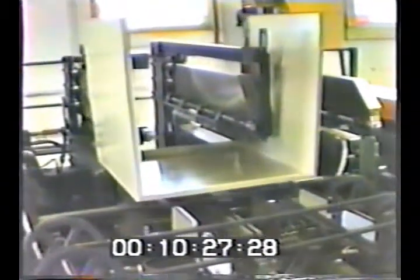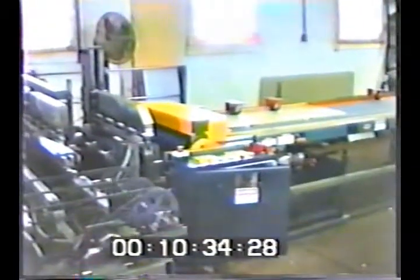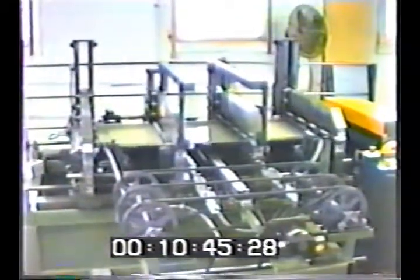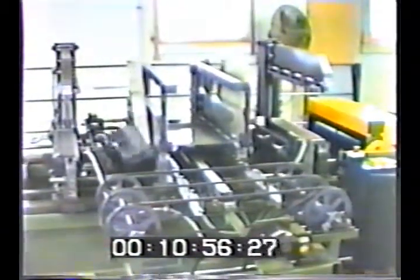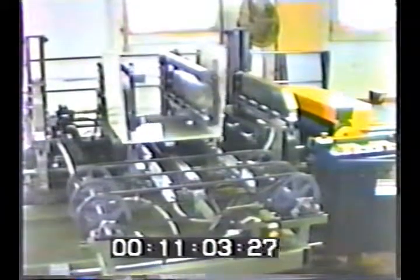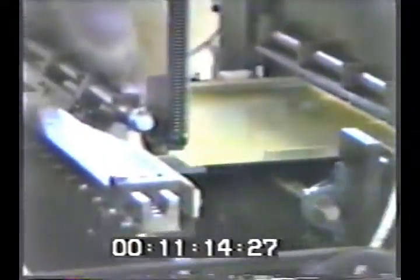The rams are set up on slide beds and pinned in location for the variety of wrapper sizes required. The entire system is designed to protect the pre-painted panels from marking or scratching the painted surface. You'll notice the open-throat ram construction allows the parts to feed from the end and eject out the side. The outer end-forming units form the 90-degree flange on both ends, then retract and clear out of the way while the inner two rams final form the part.